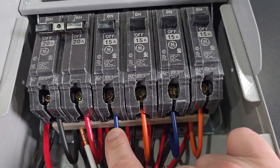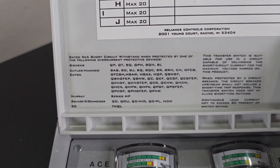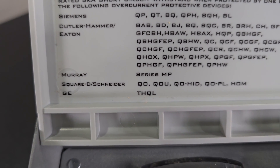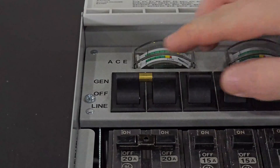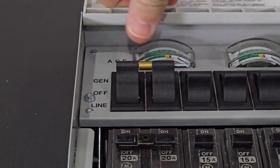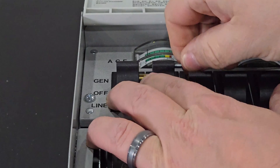We're going to replace these two with 20 amp breakers — just remove this blue wire and this orange wire and put 20 amp breakers in. It's important to get compatible breakers. At the main bottom right it says GETHQL — those are the breakers I'm putting in this panel box. Watch how easy this is to remove: flip your breaker up and start to rotate this. All we're doing is backing out the pin.